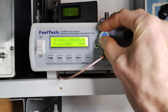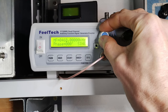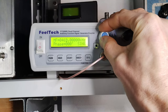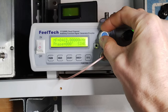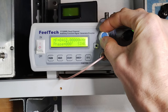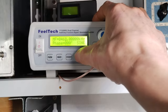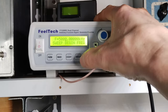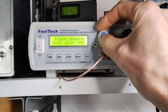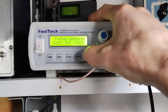A non-modulated signal generator was used to verify how the IF chain was peaked, noticing that the peak was at about 469 kHz instead of 468. Then, using the sweep function, it was possible to redo the IF alignment, trying to get a nicely shaped curve, knowing that the negative peak should be moved slightly towards the left.